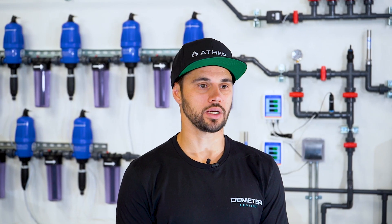Check valve. On the bottom of the stem, there are three locking rings. The top ring is the injection rate setting lock, the middle ring is the check valve locking ring, and the lowest ring is the pick up tube locking nut.